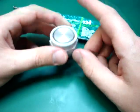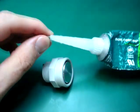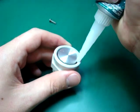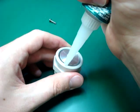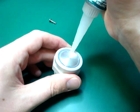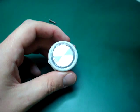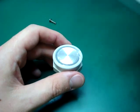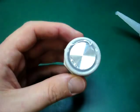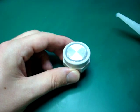If the RTV is hard, it'll interfere. I used a screw to seal off the cap — just take it off — and now I'm going to ooze in the RTV. It's better to use more than you think you need. You might also see air bubbles, and air bubbles are bad. This RTV is going to take about an hour or so to cure, so just rest it and give it some time, then we'll come back for the next part.